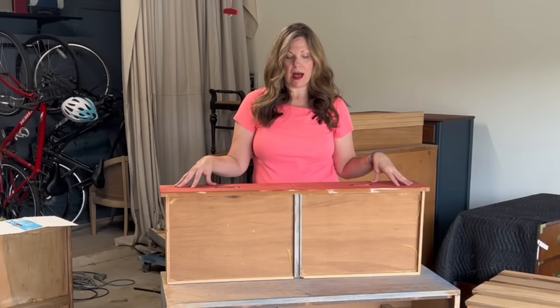Later on, I kind of had an idea. I thought, what if I propped up my wood a little bit? And that allowed me to cut it fully through. The depth on my Ryobi circular saw, I think I can only cut wood that's about 1 3/4, and this is a 2-inch block. So I had to use my miter box to cut the rest of the way. That's not ideal, but if I had a little piece of wood underneath that popped it up, that would help me get the depth that I needed.